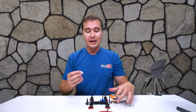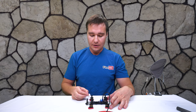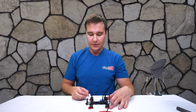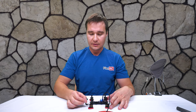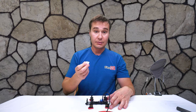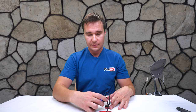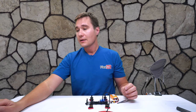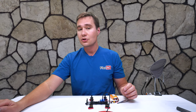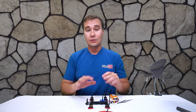Everything is spinning. The way I like to test direction of the motors — I simply use a piece of paper like that and hold it. You can see it's spinning in the correct direction. This one, correct direction. This one, correct direction as well. And this one as well. So we are lucky — no need to change the direction of the motors. That's what I like about HGLRC: I believe when you do a straight connection of the wires it always works.